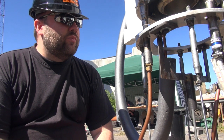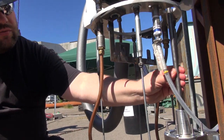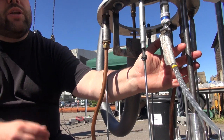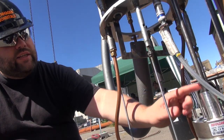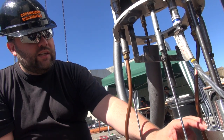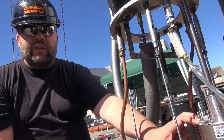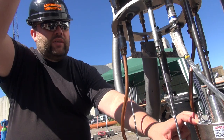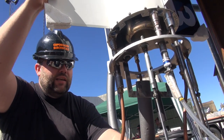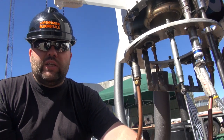We're all set up now and we've just modified the load cell system and got way better weight measurements. Apparently this vertical connecting rod was two to three degrees out of alignment when we rocked the rocket from side to side. We moved the load cell so it's directly underneath the support point of the rocket, and the fluctuations went from plus or minus 5 kilos down to about plus or minus 1.5. Now we are close enough in measurement, even when the rocket is hanging and thrashing around on the rail at sea.